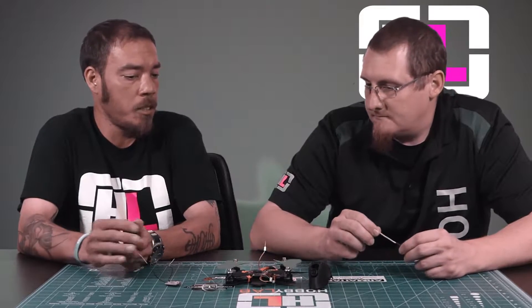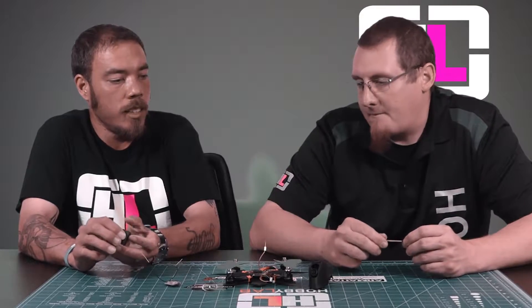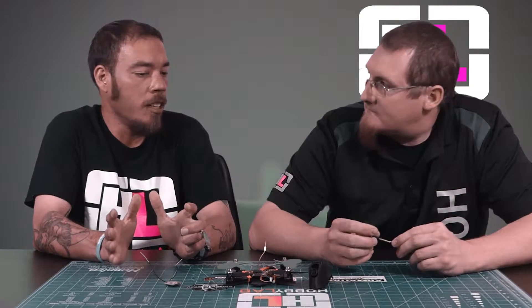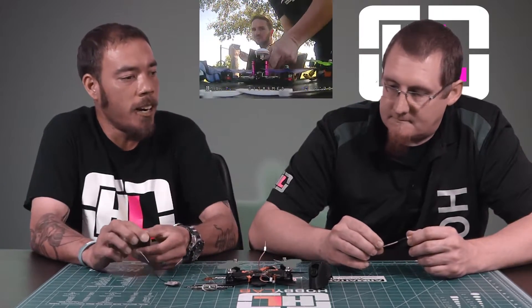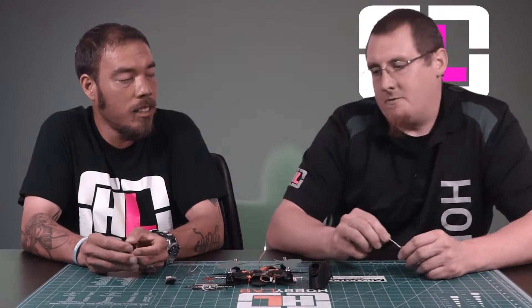How about the 200 milliwatt — is it comparable to the standard 200 milliwatts that everybody else uses? It worked really well, really clear video, but pretty standard range on the 200 milliwatt. On their website they mentioned that when you plug it in, there's zero flicker, meaning if you were flying and someone else plugged in, you wouldn't get that dead video. That is actually true — when it powers on, it goes directly to the channel it needs, unlike standard VTXes that cycle across the whole band and disrupt everyone else flying. And it actually works as stated.